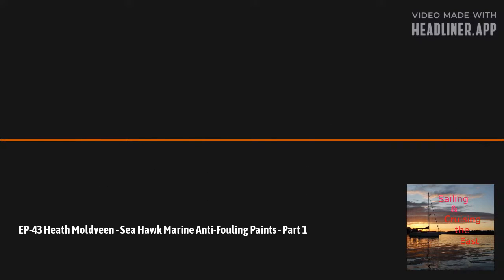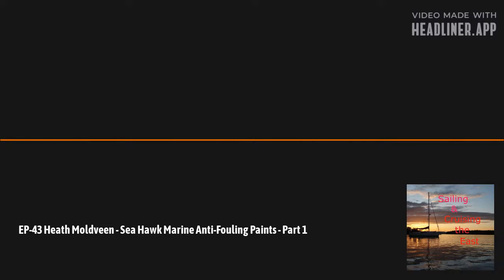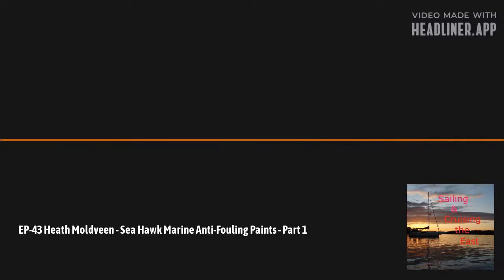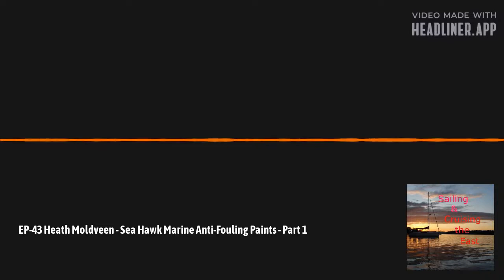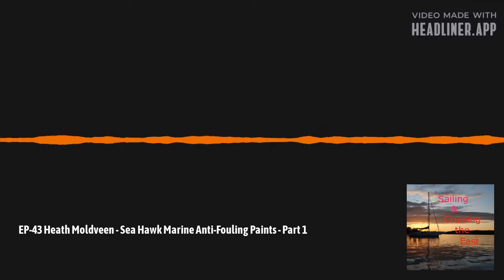Yeah. And the example you gave was, we can talk about my boat, Paradox. So in the spring, this past spring, we looked at her and we knew she needed some bottom paint. And we also looked at it and said, we've got enough layers of paint on here that at some point in the very near future, you're going to want to media blast this down back to the gel coat, like you said, and then start all over again. It's like stripping paint off of old furniture. At some point, you've got to go back to the natural wood and build up from there. So we decided to put a lower cost paint on it to get one season out of it. And the boat got hauled today, as a matter of fact. Congrats. Yeah, it's a sad day too. Yeah, it's a sad day. And hopefully it's going to get media blasted here this fall, and then we're going to paint it in the spring.